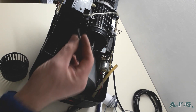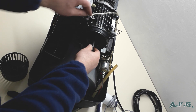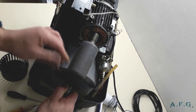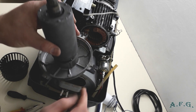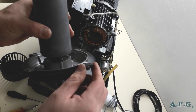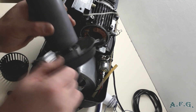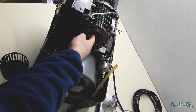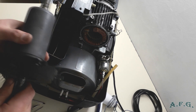Once the screws are out, you can pull the shaft with the front cover and you will see the rotor. You can see it goes in easily now because everything is already cleaned. This is a massive, very reliable professional rotor. Over here is the bearing — I'll turn it so you can see it's already oiled and moving perfectly with no vibration. What was causing the problem was rust right here and inside on the stator as well, causing friction and overheating. Now it should be all right.